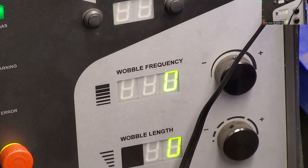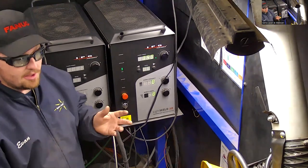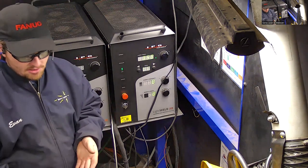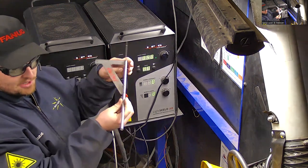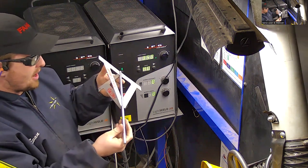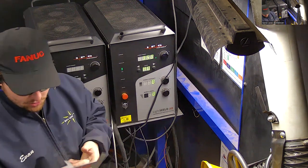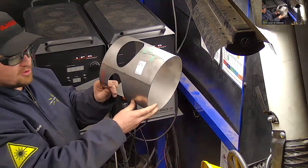Okay. Yeah, so if you're going to do a fuse weld, the only thing to consider is that your part fitment has to be perfect. There can't be any gaps if you're going to fuse weld. It has to be touching. So I kind of tacked up this part. I left the last one to show you, but these parts you could fuse weld if you wanted. The wire weld would work on this as well. You might introduce a little less heat, a little less distortion with fusion welding. This one you could fuse weld.